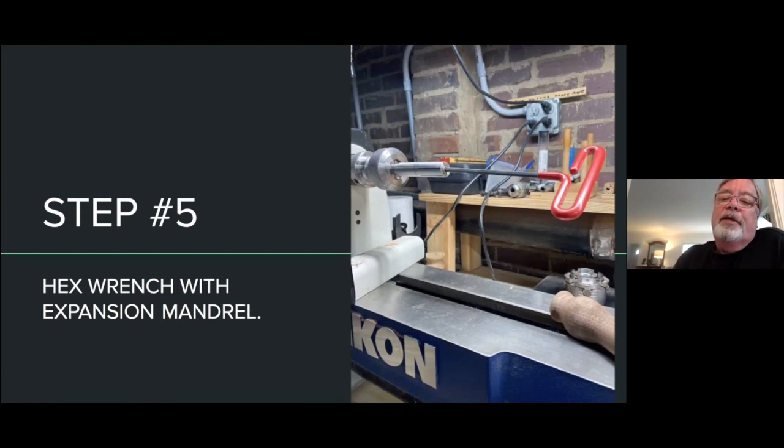Is that mounted on the lathe on a Morse taper? No, that's mounted on a Collet Chuck. That just screws on the threads on the lathe, and the part that's holding the mandrel is a nut. The Collet Chuck comes with different size inserts. I can show you those when we get through. I can just hold it up. I've got one here. So that big chuck on the end is a Collet Chuck. Right. Okay.